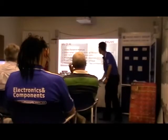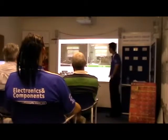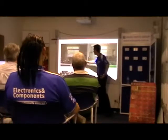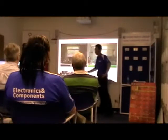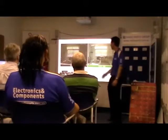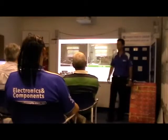Let's bring up an image. This is actually a true image that was taken at a factory in China, so it's not one we've just adapted or anything like that. So this is obviously off. You can see if anyone's walking in here or anything on the bench, you can't make it out, except with the roller door going up and down, it changes light situations. But going from dark to daytime, if someone comes in, you can't make it out. With wide dynamic range on, you can see. It's adjusted. So you can see the table, you can see if anyone's walking in.